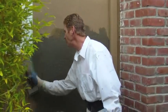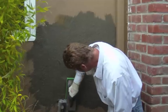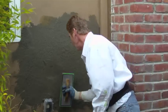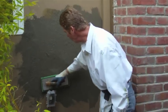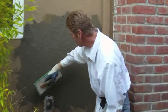And I'm feathering into the joints, feather into it. Feather into it, every which way. Feather downward. Now when it starts to drag, there's too much cement on there. Now I come down, perfect. I come up. And this again is with quite a bit of mud.